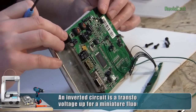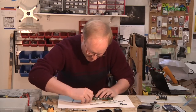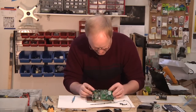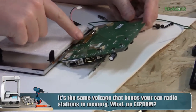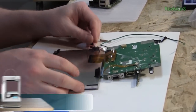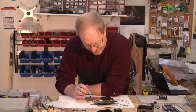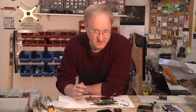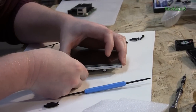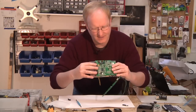I think we can compact this down a pretty good amount. I'm not sure what this wire is for — probably these screens are intended for use in a car, so this wire could be a constant power voltage source. This is going to be your data going to the screen. The connections are all through-hole, so we shouldn't have too much trouble removing them. Even the HDMI — we can desolder the through-hole ground planes for mounting purposes, then heat up the pins and lift it off. The touchscreen probably has an adhesive strip, and I should be able to remove it.